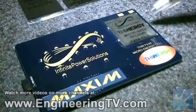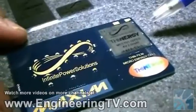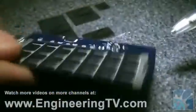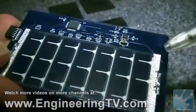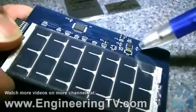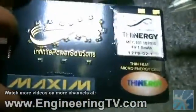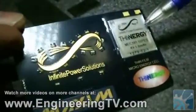Here's a demonstration of a potential application — something like a smart card, a powered smart card. What we are demonstrating here is a card that has a solar cell behind it to harvest energy from light. That energy is converted with the PMIC to charge the battery behind the card. This is the Infinite Power Solutions thin-film battery — it's as thin as paper.